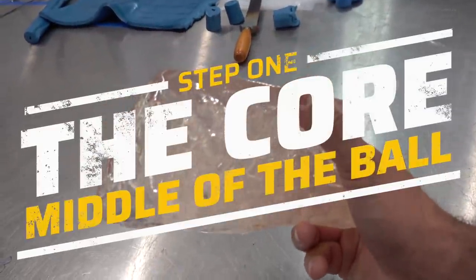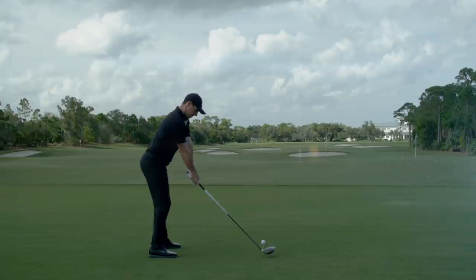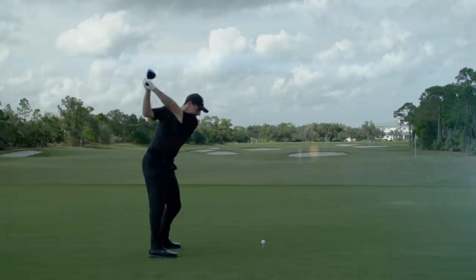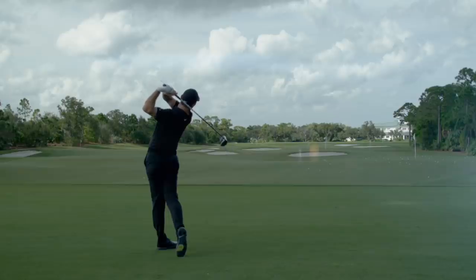Really what this lab is here to do and support this team is make prototypes. The core is the innermost component of the golf ball and it drives quite a few performance characteristics — how much spin is generated depending on the type of shot, and how the golf ball feels. Three- and four-piece golf balls have a medium compression core and build up their layers to increase velocity, but that generates more spin. So what we do on our TP5 and TP5X is start with a really, really soft core — on the TP5, it's 16 compression, and anyone in the industry would say that's soft.